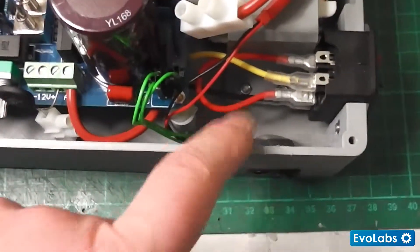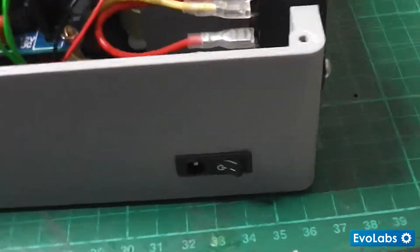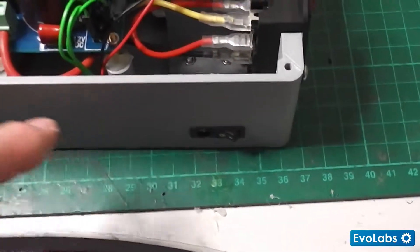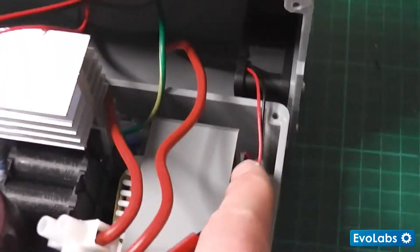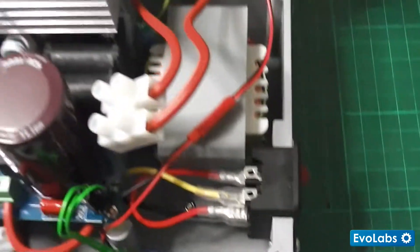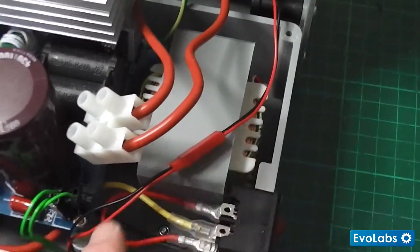The switch there I've just hot-glued in place for the DC switch, because that switch is actually intended to be soldered onto a board. But I couldn't find a DC jack and switch specifically for mounting on the side of a case, so I just adapted it. The fan comes off the DC power jack — I've got it in parallel with the input to the board — and I used a JST connector here just in case, so if the fan craps out or I need to replace the switch, these are separate and can be disconnected without having to unsolder wires.